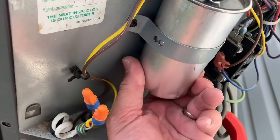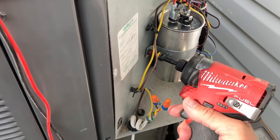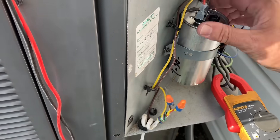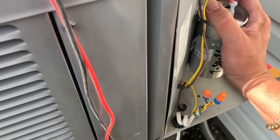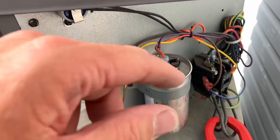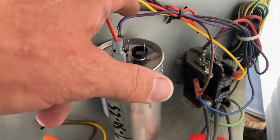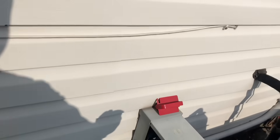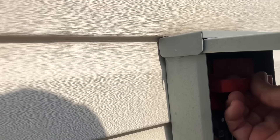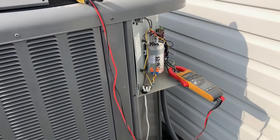My new capacitor is installed. Let me turn this a little bit — I wanted to show the date. There it is. Let's tighten it up. This is a dual capacitor but we had two wires in the old one, so it's real easy: the orange wire is our common because it's coming from power; the purple is going to HERM — hermetically sealed compressor. That's in — if we apply power we should hear that compressor start. Ready? There it is — compressor's running! Sweet, cha-ching, pay me!